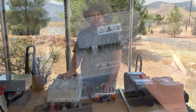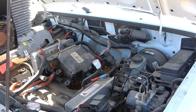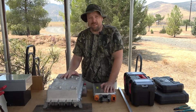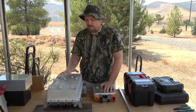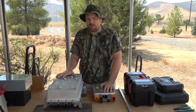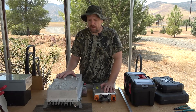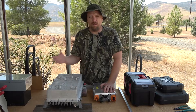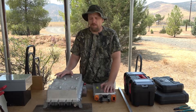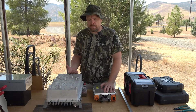One of the things I ended up doing was pulling the original charger. Just doing a teardown of this charger and seeing what's on the inside, because this is the same charging standard — you could say this is sort of like the father of the AC charging unit that Tesla was using in their cars. It also cascaded down into all subsequent automakers using level two onboard charging, whether it be the Nissan Leaf, various GM electric products, or plug-in hybrids. Most of them use an AC onboard charger that converts AC into DC for the battery.